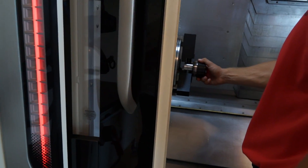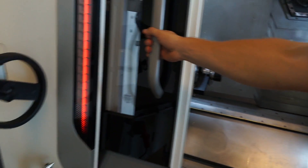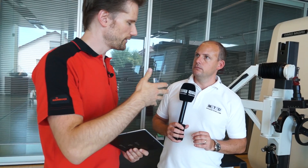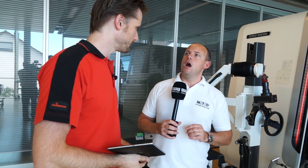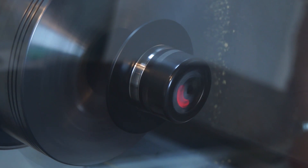Clemens, am I right — is that really what the Testit kit is for? Yes, it measures the radial clamping force, and we are now doing this to see the difference between the static clamping force and the clamping force with a rotating spindle. So would I be right in saying this is important if you're doing thin-walled components, or just want to make sure the condition of your chuck is in prime condition? Yes, always important so that the workpiece will not leave the chuck uncontrolled, and especially for thin-walled workpieces since you can crush them.